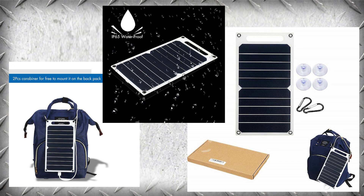I ended up retesting this one the next day at noontime in full sunlight. I angled it directly at the sun and was getting between four and five watts — pretty good. As an added test, I put my phone in the glove box and placed this on the dash while I went grocery shopping. After about 50 minutes it charged 20%, from 50% to about 70%. A full 12-watt fast charge at the wall would have probably taken it from 50% to full in about an hour. So we got a little less than half that, but that's probably an average of four and a half to five watts — pretty darn good.